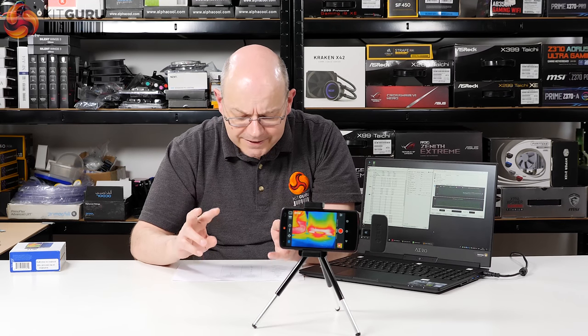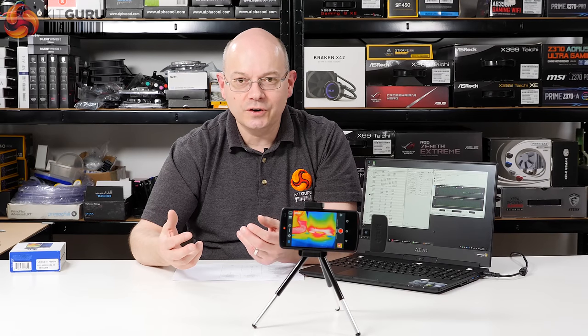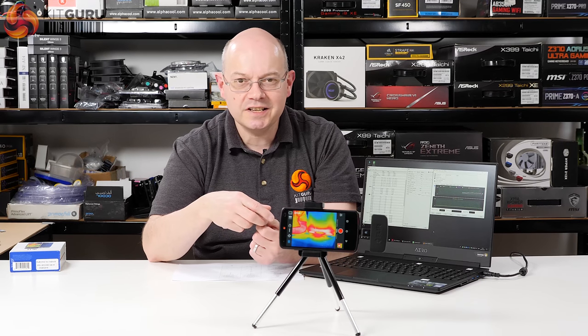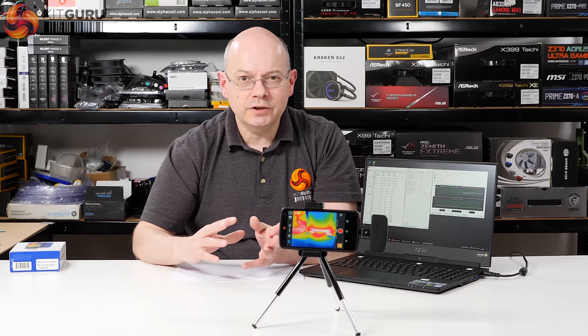You also have to be careful with the FLIR One because infrared really gets confused by things like glass. If you point a thermal camera at a PC case with a glass panel in the way, the figures will be completely nonsensical. Nonetheless, used with caution it's a handy little tool and it generates interesting images — that's why I've got it. I didn't major on infrared in the review, for good reason.